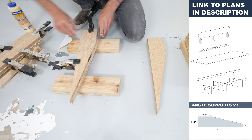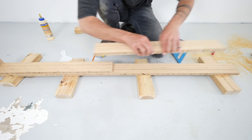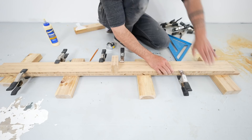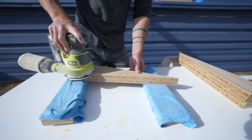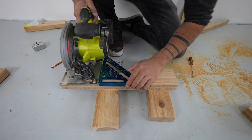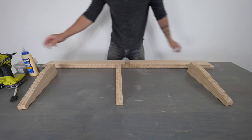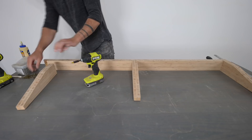If you want to save some plywood you could substitute 2x4s for these pieces. I made a base plate that was the same width as the bottom of these angled supports and I wanted notches to lock in the supports. But instead of cutting them with a jigsaw I just cut the pieces so that when I laminated the two layers together the gaps are built right in. I sanded down the angle supports — this took a little bit of time because I had to bring those imperfect angled edges nice and even. Once they were even I just trimmed off the sharp tips and now I had three angled supports that were all exactly the same length. These supports fit right into the notches that I made in the base plate. I just added in a little wood glue into those notches and then screwed in the angled supports. My fit was pretty tight so I just used a clamp to really make sure I was pushing that support all the way down.